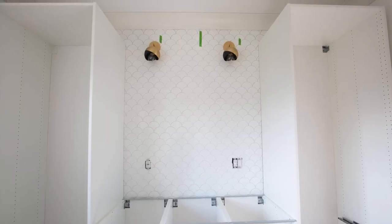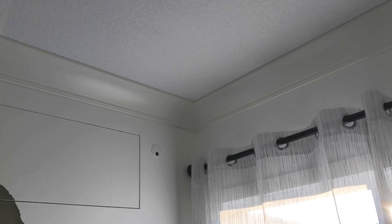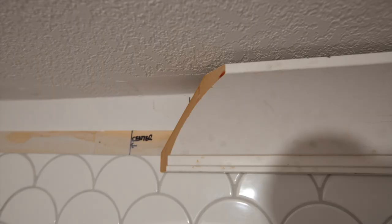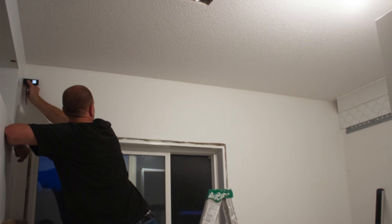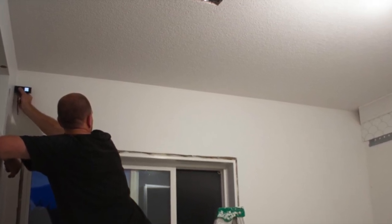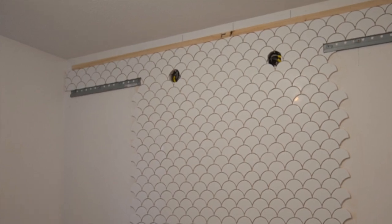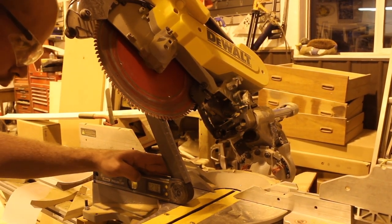Now that we've shown you our trick for adding crown molding to a tiled wall, we'll show you exactly how to cut and install it. There are a couple of things you need to know before you cut your first piece of molding. First, you need to know whether you are working with an inside edge or an outside edge on your wall. Next, you need to know the angle of your molding — usually the spring angle will be either 45 degrees or 38 degrees. You also need to know the length of your crown molding piece — we use our laser distance measuring tool for this — and the angle of the corner of your wall. Many times the wall isn't an exact 90 degrees, so we recommend using an angle measuring tool to measure it.